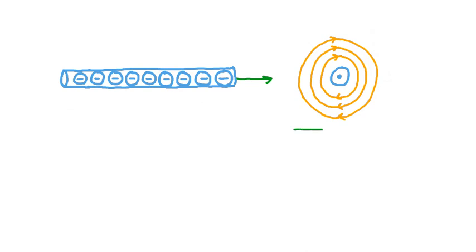Notice a couple of things about this magnetic field. For one thing, it has a direction — each magnetic field line has an arrow which shows which way it points. Another thing to see is that if we look at the direction of the flow of electric charge along this axis right through the conductor, we see that the direction the charge moves is always perpendicular to the direction of the magnetic field. And that's always the case: the magnetic field produced by a moving charge always points perpendicular to that motion.